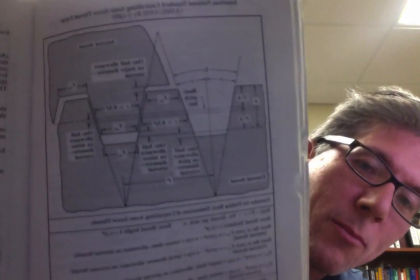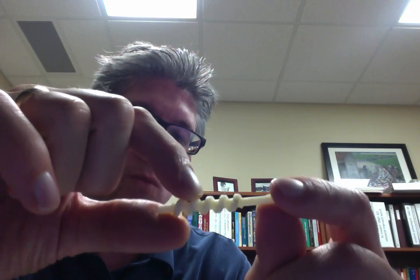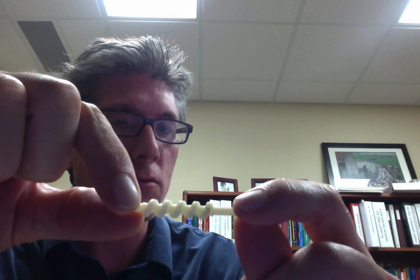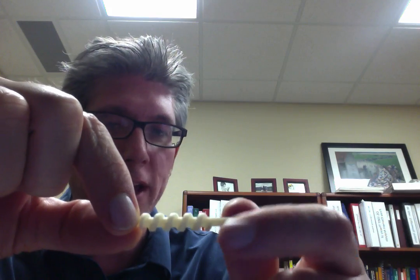So we've talked about this. I post some of this stuff from Machinery's Handbook on the Blackboard site. First I tried making a conventional Acme thread geometry, and what you find is for shafts about this dimension — where we might be looking for this gripper project — the thread width is pretty small and probably not what we want. It would have a lot of difficulty fabricating in the rapid prototype machine. So I modified the geometry. It's a little non-standard, but it's basically a 60-degree face angle and about a quarter-inch pitch.